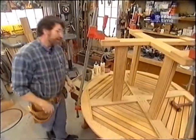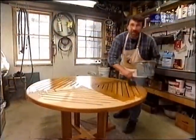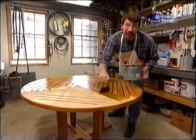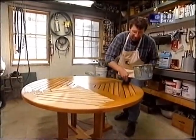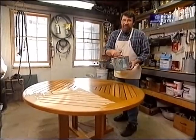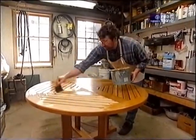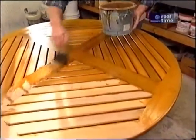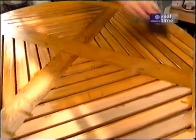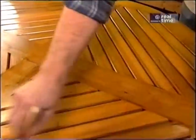While that's drying we'll set up the paint shop. Several years ago we built an outdoor lidded bench out of cypress and didn't put a finish on it — we hoped the wood would turn a nice light silvery gray like teak or cedar does. The project held together well but we were disappointed in the look; it came out kind of dark and blotchy. So for this project I'm putting on a protective finish that's a combination of oil and alkyd resins — used on boats, decks, and outdoor furniture. It has UV protection and repels water and snow, so that should give our piece plenty of protection.